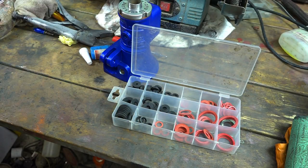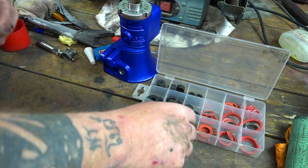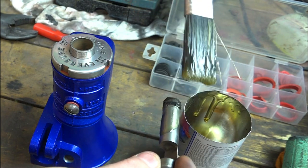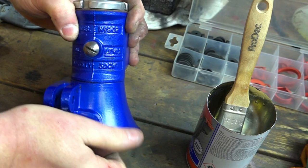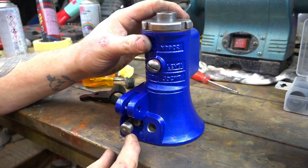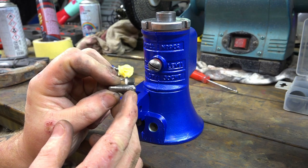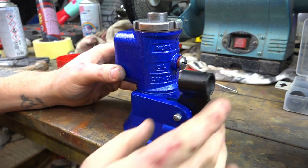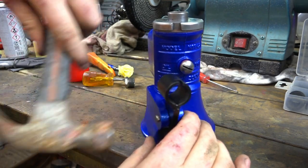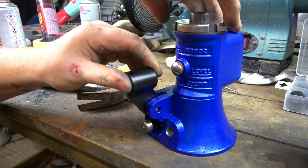I've got all new gaskets. The first one is for this little bolt. The plunger for the base - obviously we'll lubricate that again. That's in there. So now we've put our plunger in, which is what jacks it up and down, creates hydraulic pressure. Remember this had some spindles on the end of it. Place that back into the hole and then it will sit there. Just give that a gentle tap - don't need to go crazy with that. And there you go. And that's your pump.